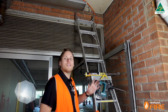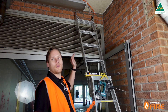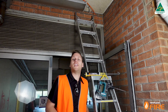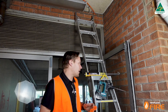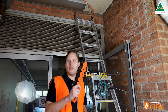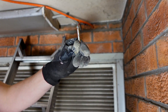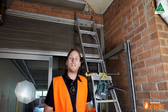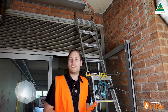We're on site now and we've found a head of wall penetration where we've got some conduits and some cables all going across the top of the wall, which is the perfect candidate for a fire strap system. To install this you're going to need Firepex HP sealant, a hammer drill, a fire strap for both sides of the wall, and some M6 by 50mm dyna bolts. You'll also need to check the technical manual to make sure that what you have here is represented by one of our tested systems.